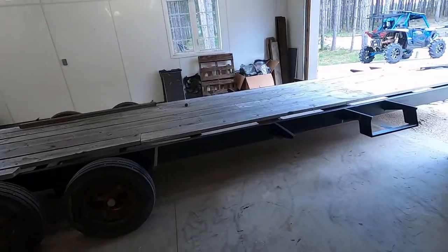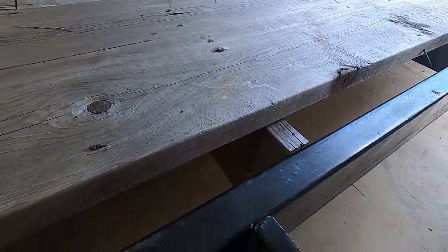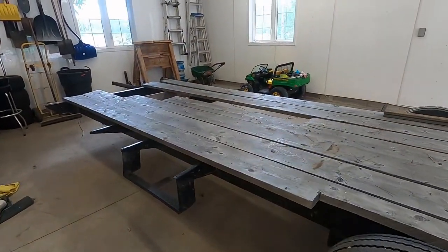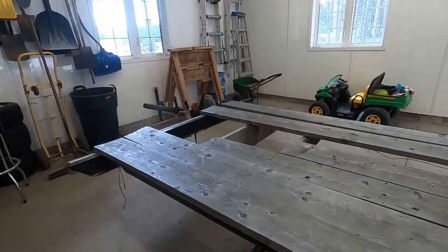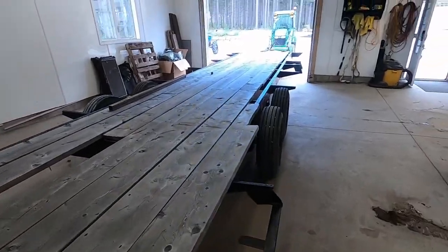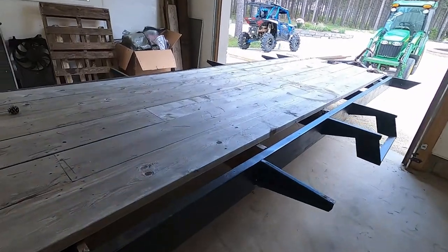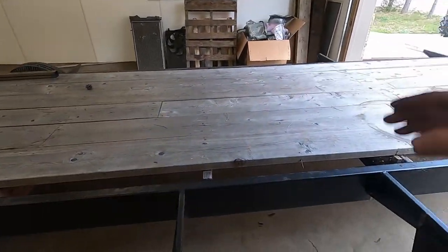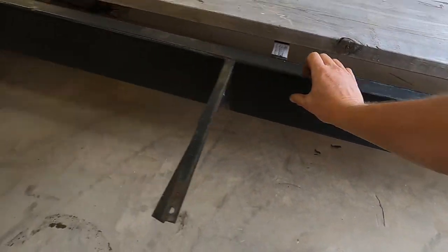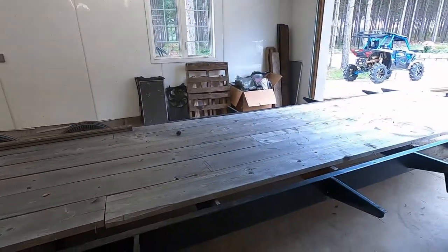I'm going to get all these pieces cut off. Some are already cracked. They're all coming off: steps coming off, backs coming off, all the wood's coming off. I might leave some of the wood in the center because it is nice to bolt to. And then I have all that tubing right there. I'm going to put a crosser in between each run and run a full length of that heavy weld 2x2 all the way along the side. That'll give us basically our width for the RZR, 72.